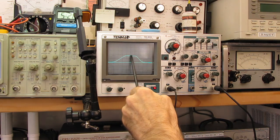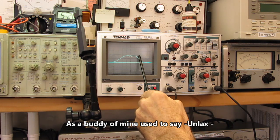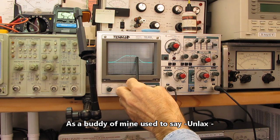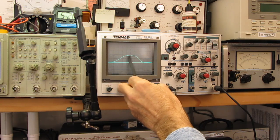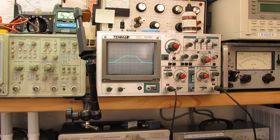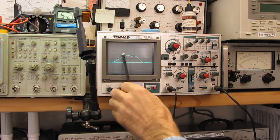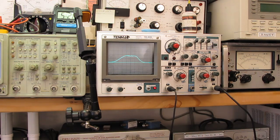So this gives us 75 kilohertz of bandwidth, 150 kilohertz total. And we've actually got a little more than that because it doesn't even drop to the 3 dB point until well outside. But we've centered up on our 10.7 IF, which is important because our frequency is going to deviate back and forth from the center frequency, and we want to have equal gain for the IF on both sides of our center frequency. If that makes sense, I hope.